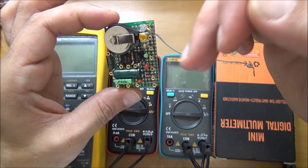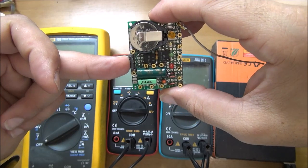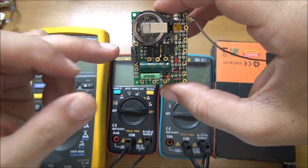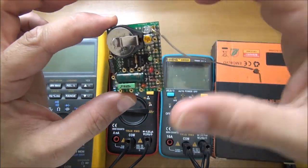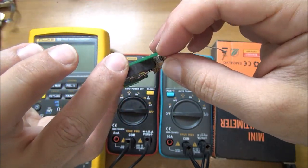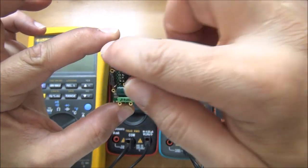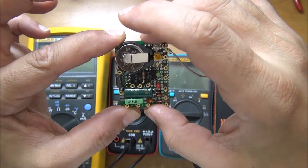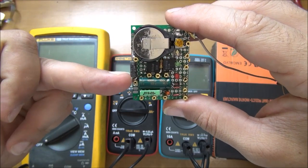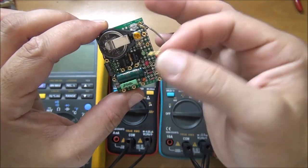This resistor works like a shunt — it's measuring the current through the battery. If you choose different devices you get different values, and you can also get fluctuating millivolt readings because this LED has special behavior: it changes color, and by changing color it produces a varying current on the circuit, giving you a fluctuating voltage. If I plug the strap here...